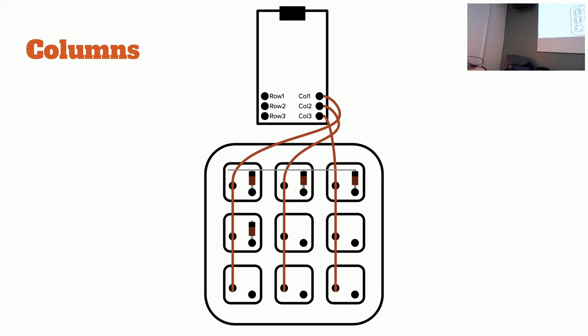Sure. You can program it so that you can have multiple layers too. Hold one down and then it's now other numbers. With QMK, you're basically limited to the size of the EEPROM memory, and it's 32K. So you can do a lot with that. You could have 20 layers. And then there's tap dance, which is tap codes to switch layers that you can do.